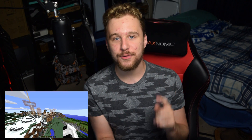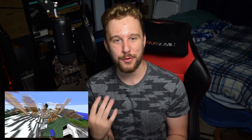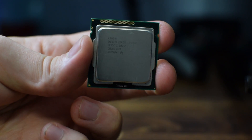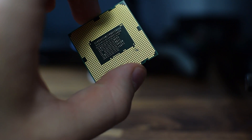The main reason I actually built this was after an inspired conversation on our last Toasty Tech live stream that me and Jackson do every week — we talked about the idea of creating a Minecraft server. We were having a throwback conversation about Minecraft and when we used to host Minecraft servers on the YouTube channel way back when the channel first started. So I decided to take the time to make a machine that could do server hosting for Minecraft, be near silent as long as I needed to host, and could just sit there for whatever other games we wanted to do as well. The i3-2100 and 8 gigabytes of RAM is plenty for the needs of a Minecraft server — upwards of 100 plus people, which is more than we need — and we could throw some add-ons on there if we wanted to try it out.